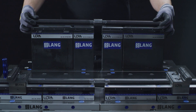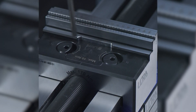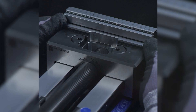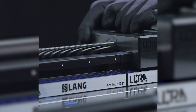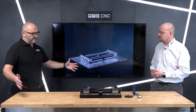The jaws are also the patented part of the system. If you want to slide the jaw to different lengths, it's just as simple as undoing two cams — we've got a magnetic tool that pulls out a screw that encapsulates the spindle — and the jaw is then free to slide backwards and forwards to set it wherever you need to.